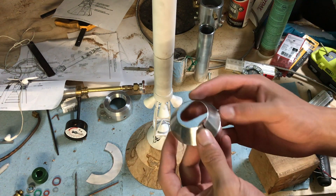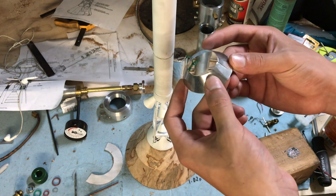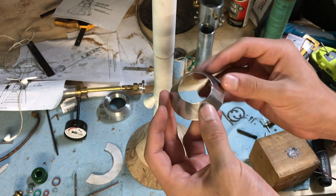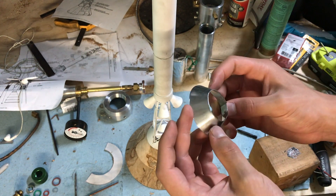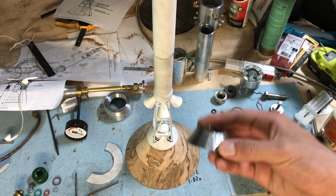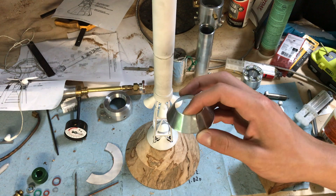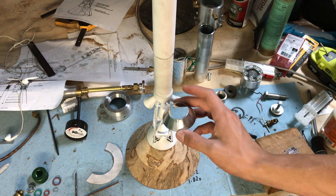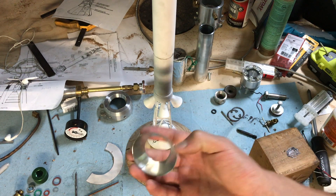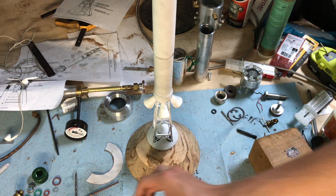I've cut a little template - a little cold rolled steel cone - and I thought this would work, but I'm not quite happy with how it's bending. It doesn't look completely smooth, and the diameters are a little bit wonky. So I think what I'm going to try and do is weld this up - I haven't even welded it together yet - weld that seam from the back, and then maybe find a way to put it on a mandrel on the lathe. That's not super important, so I'll see if I can knock that out when I have some spare time.